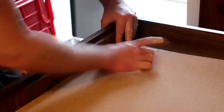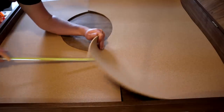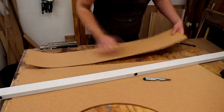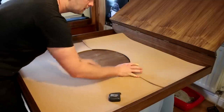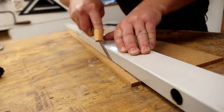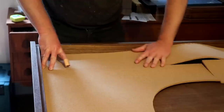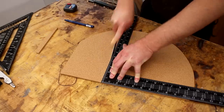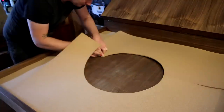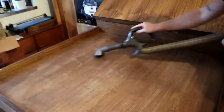I offered up the cork to the inside of the cabinet making sure it was tucked underneath the top panel, then measured how much to remove from the bottom piece of cork and cut that with a knife — and that seemed to fit pretty well. I'd need to use an offcut to fill the rest of the back panel, then just one small square to fill the last corner, cut from the piece removed earlier. I made some marks to represent where each panel of cork was to help figure out where to apply the glue, then hoovered off any dust.